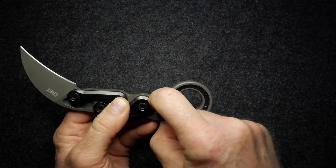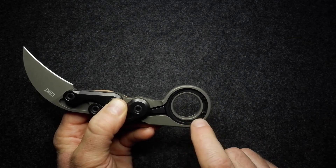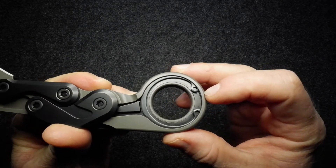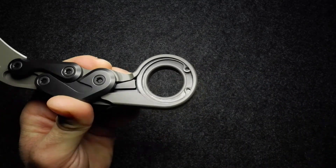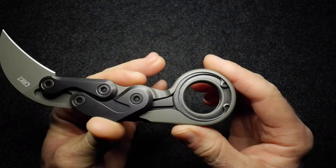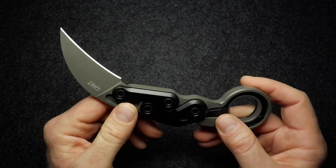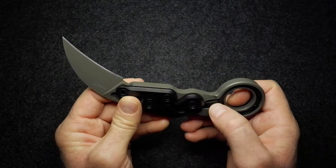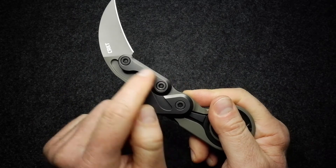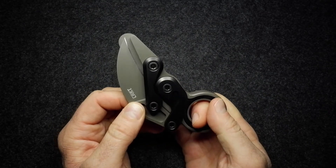This point is spring-loaded — the lock I'm pointing to — and there's some sort of spring mechanism inside. I noticed there are circlips around this portion of the handle; you can see the two little eyes there, so with circlip pliers you can get that spring out, which would form part of disassembly. The Torx screws handle the rest. I saw earlier versions with flat screws, and read reports of those coming loose. The later versions now use Torx throughout, and presumably something has been done to address that.